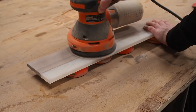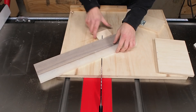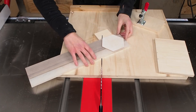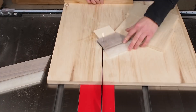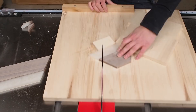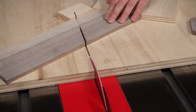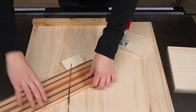To cut the hexagons, I'm going to use a hexagon cutting sled that I made a while back — I have a separate video for this. The way it works is that I first remove the stop so I can fit the blank and make the first cut. It helps to first cut a template to position the blank and minimize wastage. After making the first cut, I put the stop back into place and clamp it down. Then it's just a matter of nesting it up against the stops and cutting one side at a time, rotating the piece as you go. I took my time to always make sure the piece was properly seated with no gaps before making each cut — otherwise it's easy to throw your hexagon out of whack. Once the first hexagon is done, grab the off-cut and repeat the same process, moving the piece around in a clockwise direction.